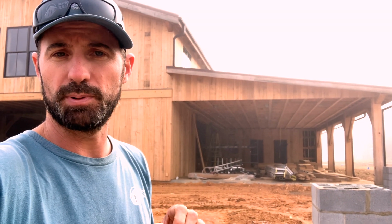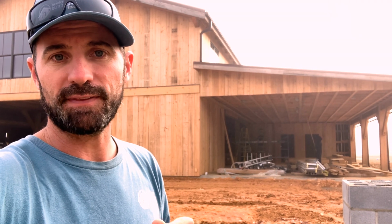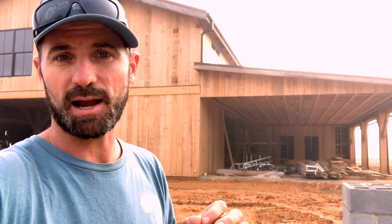And what I mean by that is that trusses tend to be, some of them are really crowned like this and other ones are bowed down, and when you stack them all together next to one another, they're not flat. They don't make a very flat ceiling. So we use the strapping to do two things: to flatten out the ceiling and distribute the load as trusses expand and contract differently. Those 2x4 straps absorb a lot of that load, so you have much fewer cracks in your drywall, if any at all.